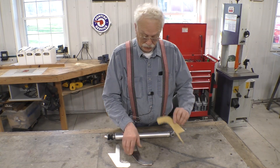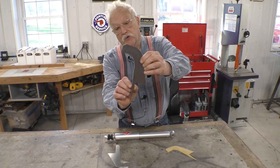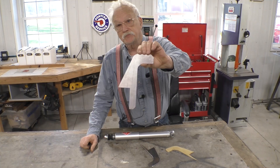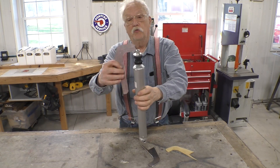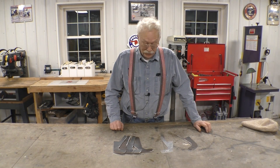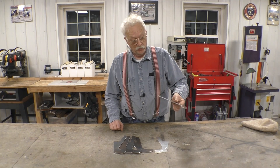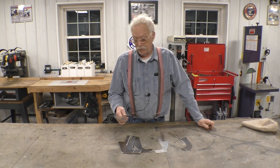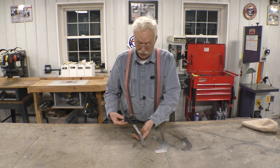Here's our pattern. This is the first piece that we've cut out, but there's a major flaw — this piece right here is too thin to weld to, it's not going to have any strength. So I've made a new pattern out of aluminum: it's much thicker down here, will have a lot of strength, and the shock will fit very nicely in there. We now have four brackets cut out roughly. What we're going to do is take them to the sandblaster and get all the scale off, then stack them all up together.